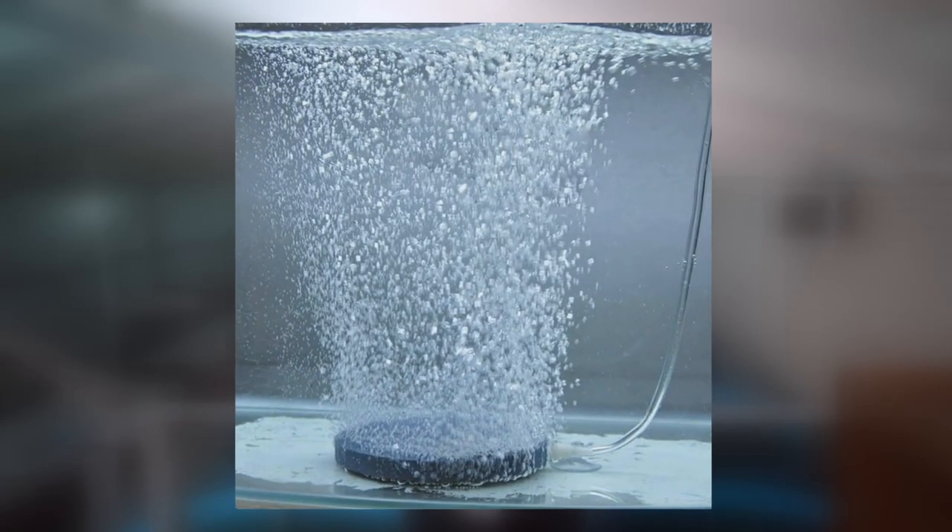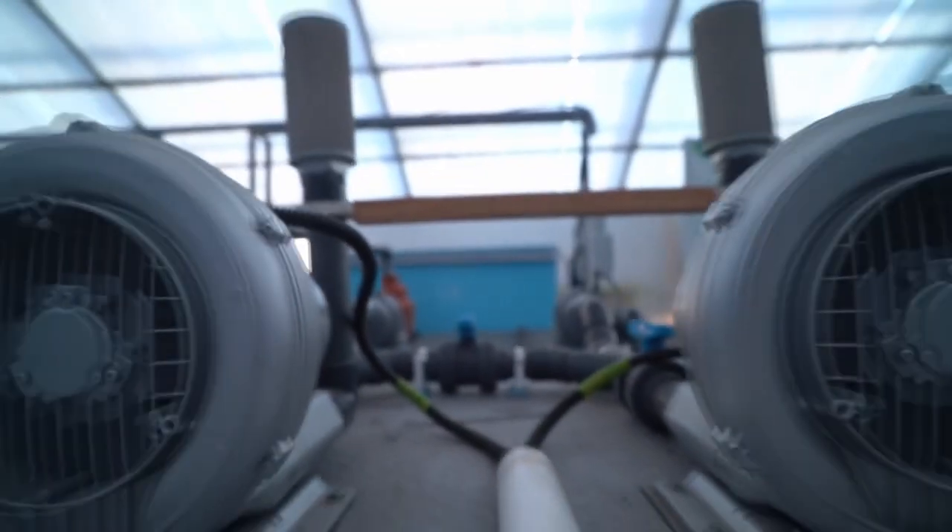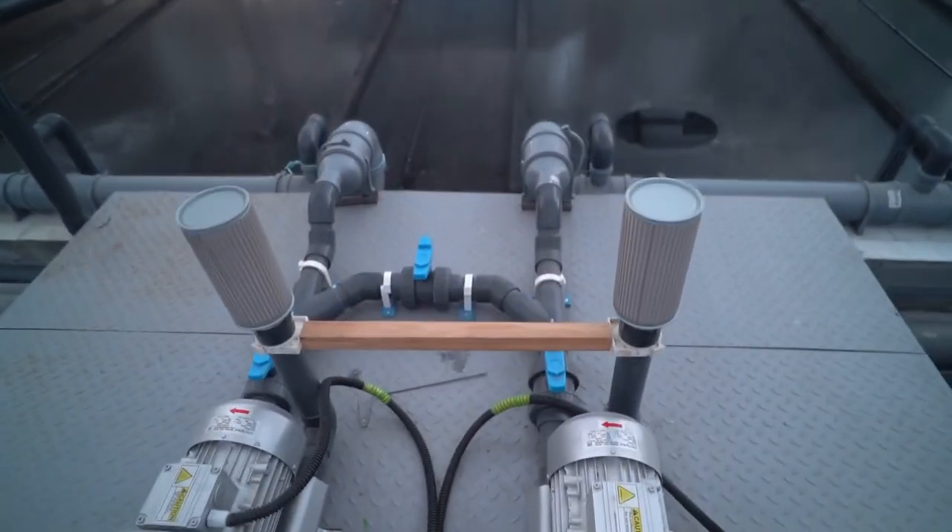The second option involves aerating water with atmospheric air. For example, an aerator is placed on the pond, water cascades down and breaks into droplets, maximizing the contact area of oxygen and water so that water is saturated via accelerated diffusion. Another method involves placing diffusers at the bottom of tanks — air is supplied from blowers and accordingly the water is saturated with oxygen from the atmosphere.